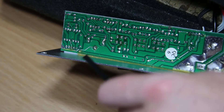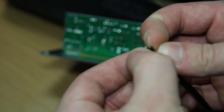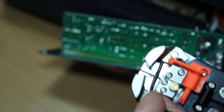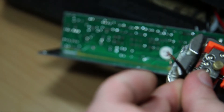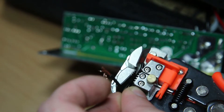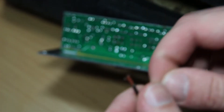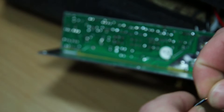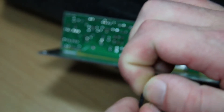I've got this normal figure-eight wire that I like to use - it's real copper, that's the main thing. I'm just going to split the two wires apart. This is my wire stripping tool, I absolutely love it, it works so well - it's only about a tenner on eBay. Just twist those ends over - that's really just to stop them getting messy before I start soldering. If you don't twist them, the little strands of copper go all over the place. I'll fold these over a little bit just to make a smaller contact area.